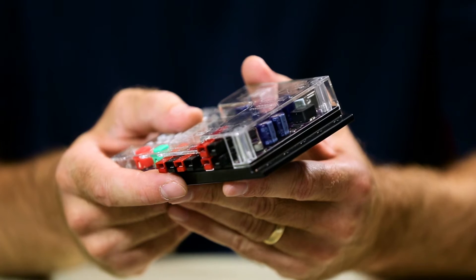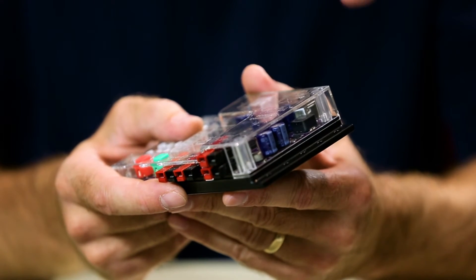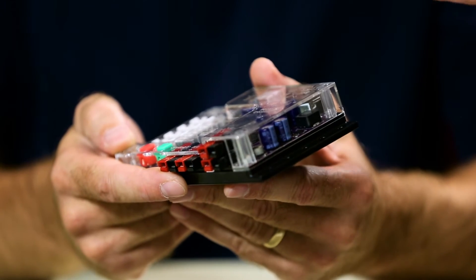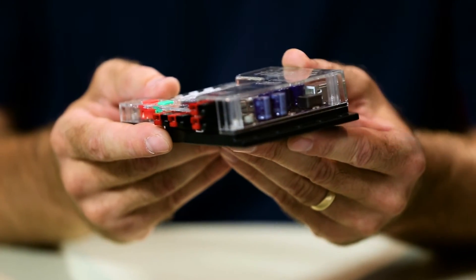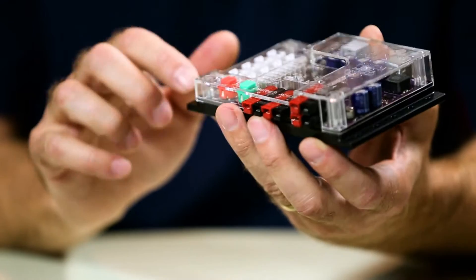So to summarize, we've got an awesome standalone controller with a rich feature set: eight sensors total with specialty sensor ports, DC motors plus servo motors, the ability to connect power in and out through expansion, and a standard USB connector. And this awesome look comes from a clear case — the top is made from clear polycarbonate, which is very tough. Polycarbonate is used in some bulletproof devices, so this controller will stand up to a lot of abuse.